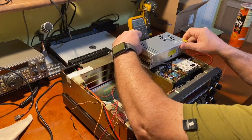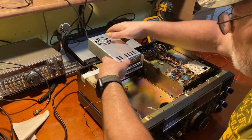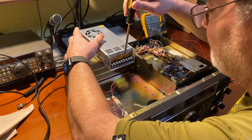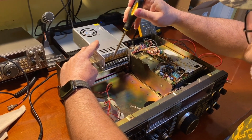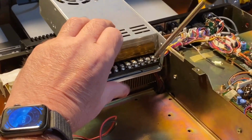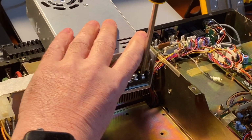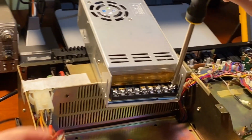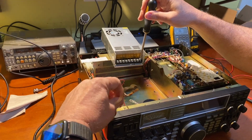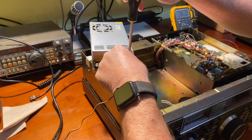Okay, let's see here. Let me pop the cover off. Raises up. All right, let me get a screwdriver out of here. All right, we got 3 positive lines, 3 negative lines, and then this is our ground, our neutral and our line. So, since we're shaking so bad, the first one here will be our line, which is the switched one, which will be orange. Orange is our 120 volts coming in. So we will hook our 120 volts here.